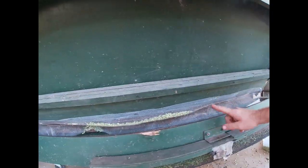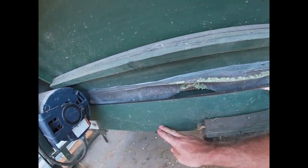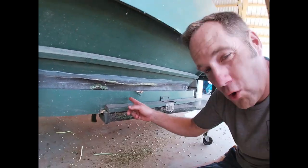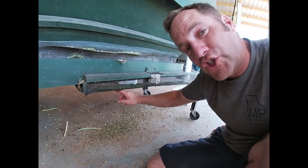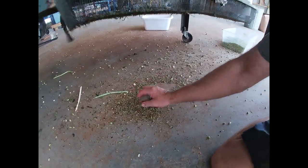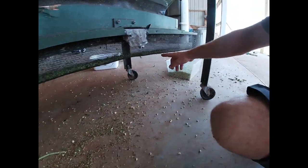As they fall out right here, they come down and there are two PVC pipes mounted at an angle, one on either side. All the peas go into these pipes and they vibrate to the middle. There's a hole in the middle — peas come from both sides falling down. They hit this little screen called a shaker pan. It shakes and the fine stuff shakes out, so this is cleaning the product as the peas travel downhill.